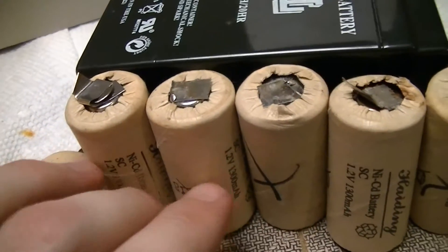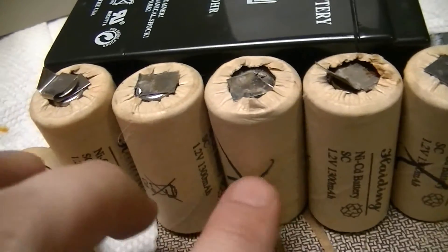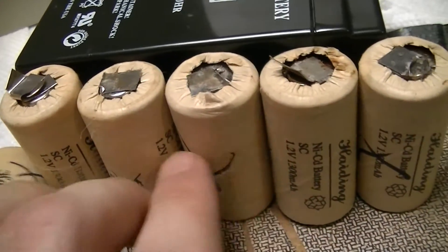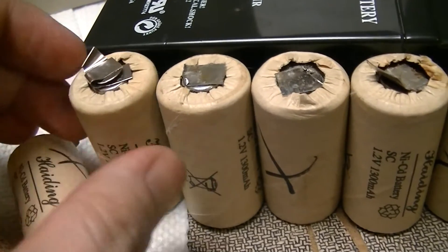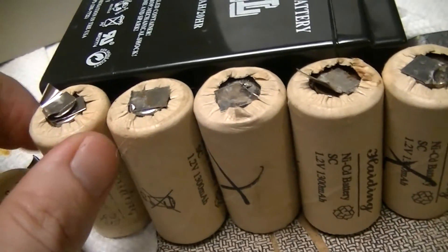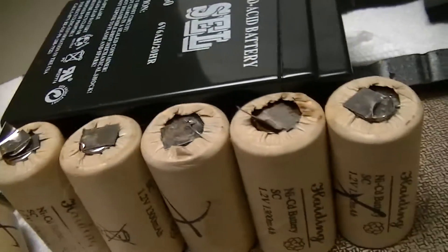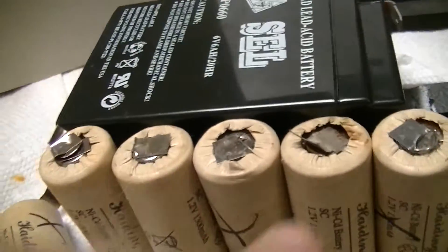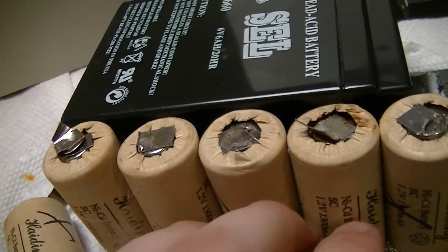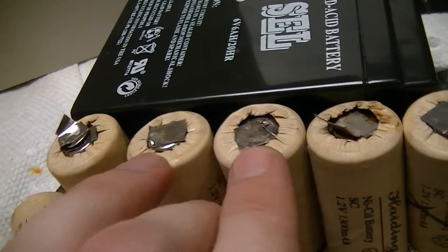The battery is just going to be made of a bunch of sub-C nickel cadmium cells — these ones are all dead, hence the black X's on them, out of a battery I was reforming. What I'm going to do is build a pair of 3x5 packs. Of course, if you're building your own batteries with these things, there's a risk of shorting — not so much risk of electrocution, although you might be able to do something stupid if you got up to a few tens of volts, because the tabs are sharp on these.